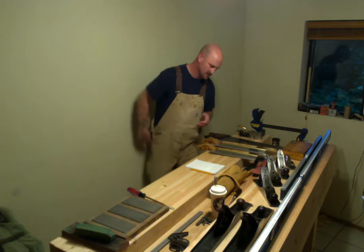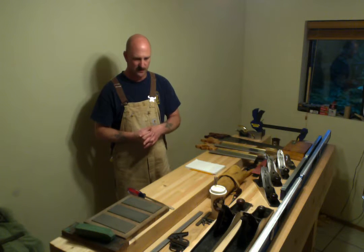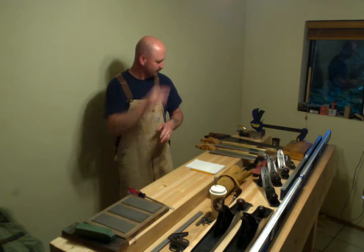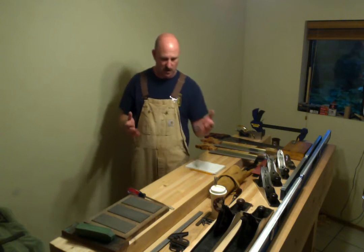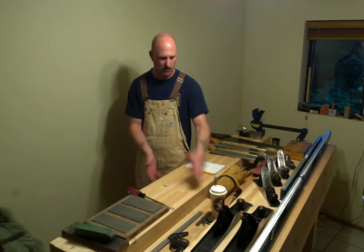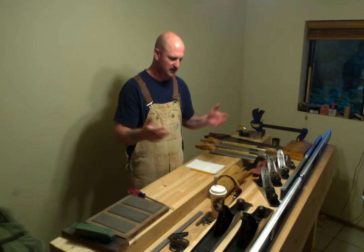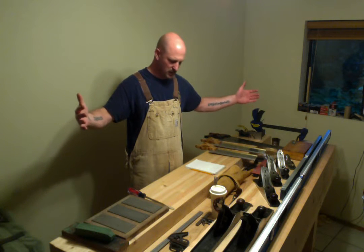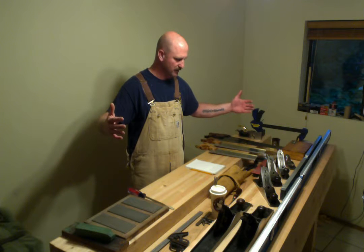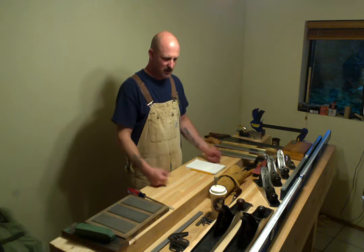Like everybody says, you can never have enough clamps, and if you don't know that now, you soon will. So get a lot of clamps that are going to be long enough to clamp your laminations together, whether your aprons or your tops, or your wellboard, but also have some long enough that are going to hold your leg frames together. I would guess the longest clamp that I needed to use was a 5-footer. A set of 5-footers.